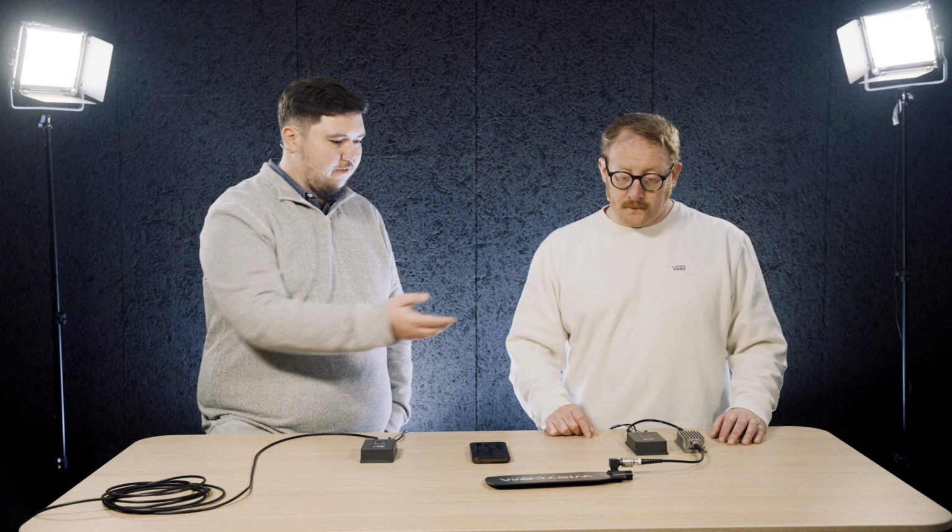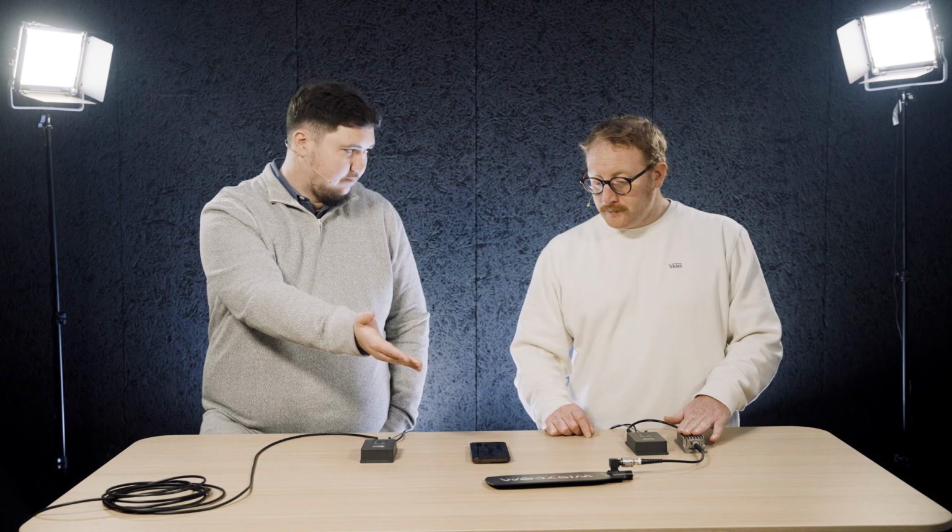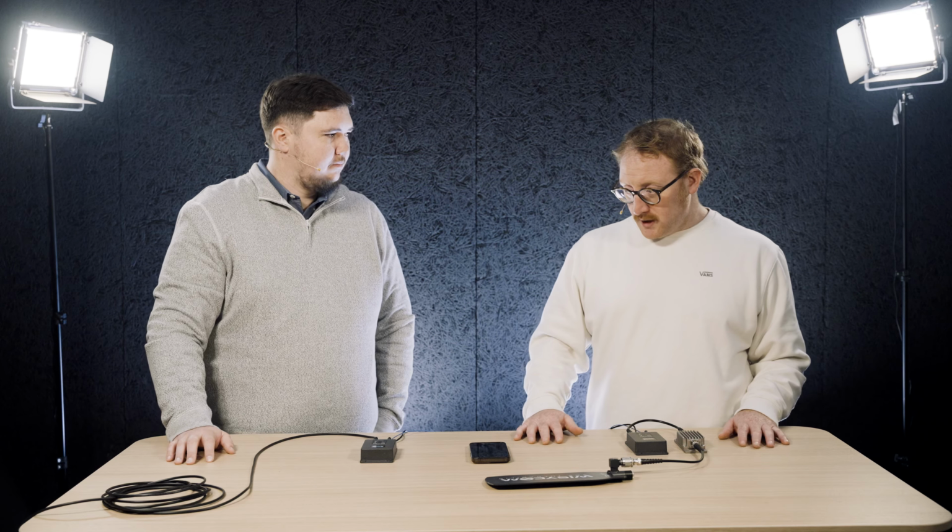Yeah, and so on your remote side, you'll just need a couple of components, and this is for doing single carrier. There are a lot of situations where you can do multiple, and that kind of changes. It's all RF math, and the biggest thing that changes is which amplifier you're using. We make a couple of options, but for this, we'll just talk about single carrier. For that, you'll need the BFLR, and our main amplifier for that is called a PAW, and then an antenna. Yeah, correct.